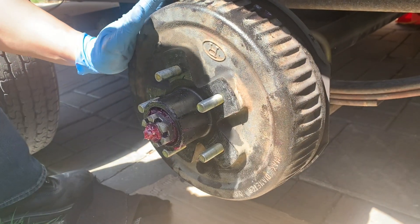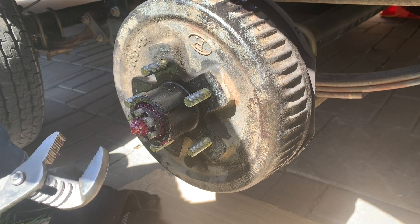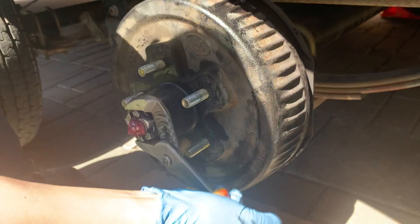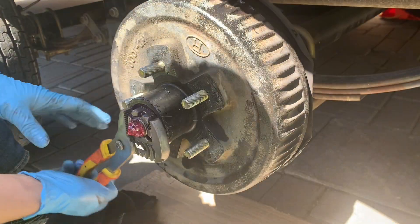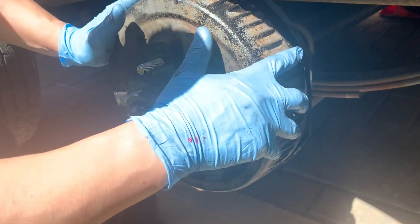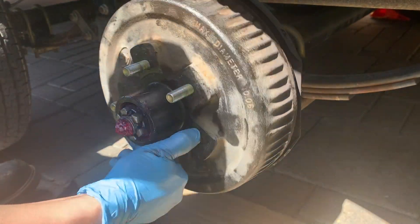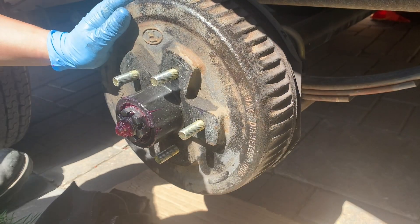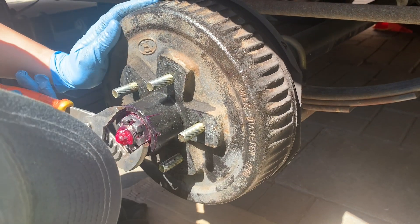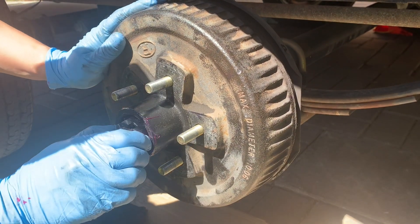It's still a little loose so I keep tightening it. You can see it's moving but still pretty tight — I find the spot where it's tightened up, and then I back it off a little bit so it can roll more freely. Before I took this off I had spun it to see how smooth it was rolling, and I'm going to basically match that.